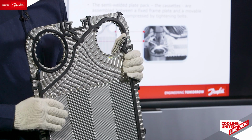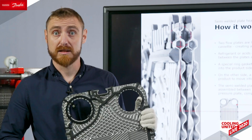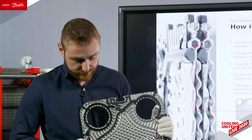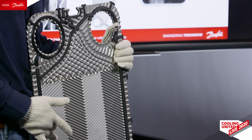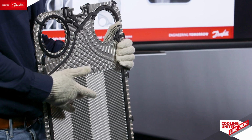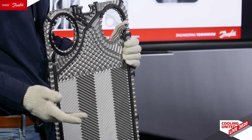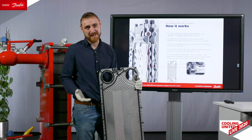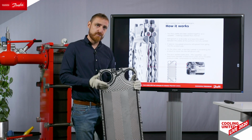As I said, over the last couple of years we have been developing the plate design. We have namely introduced some new features, such as we have changed the heat transfer area. This part here, this is where the heat transfer actually happens. We made more aggressive pitch, meaning more contact points per square meter, which is contributing to the higher thermal efficiency. We have this chevron in 3 plate patterns actually, to utilize in the best way the pressure drop and the thermal performance each time.